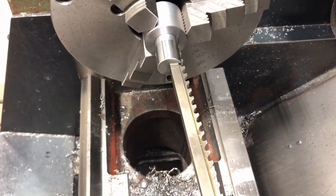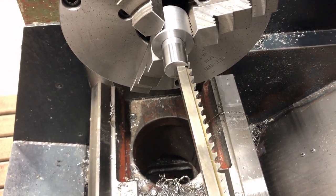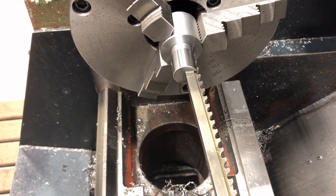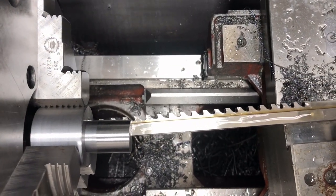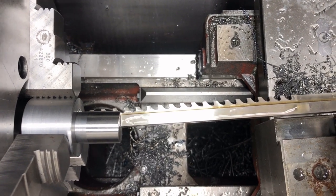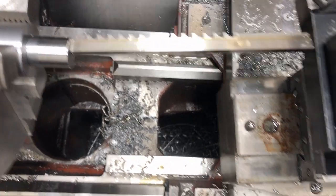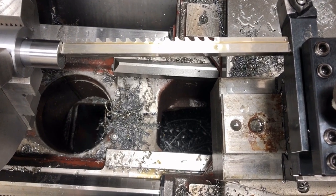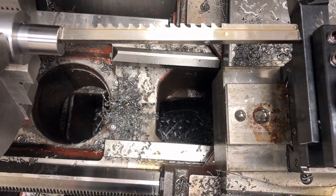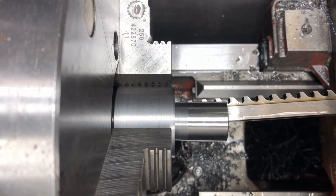The bushing is at about a three and a half degree angle, which is the angle of the taper. One of the things I hadn't figured out when I started was how I was going to hold it and run the broach through with my hydraulic press at that angle — how to make a ledge so the broach was straight up and down, since that's all a hydraulic press can do. But when I had it in the lathe test fitting, I realized that with the compound rest at the same angle I can push with the compound rest, pushing the broach parallel to the slot in the bushing, while the plug stays in the lathe held with the three-jaw chuck.